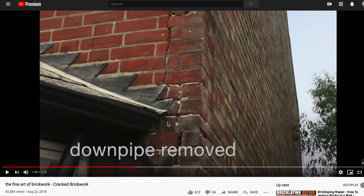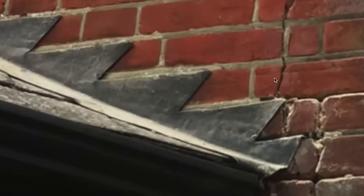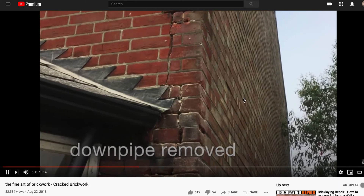You can come here and look at his video and see this and critique it. This wall looks pretty stable — this entire foundation, everything is continuous. There's no water that flows off there, so the water appears to flow front, left and right. Maybe there's a downspout that flows here — I think there's a downspout right here from this roof that was connected. That saturated the foundation somehow. It's got water down there and rotated it. Again, we've got an inward rotation towards the house.